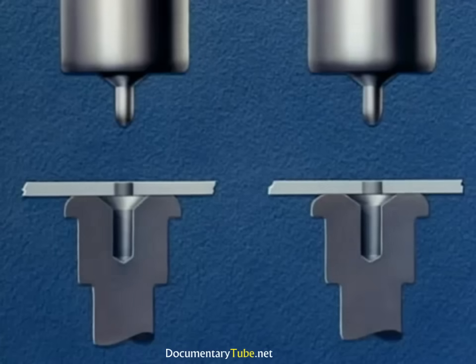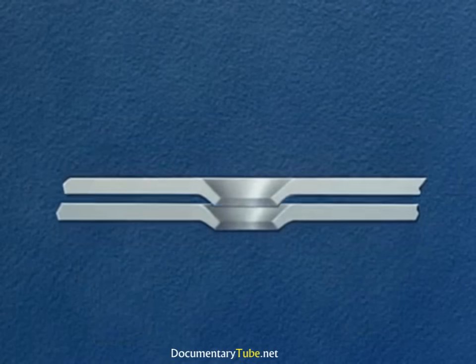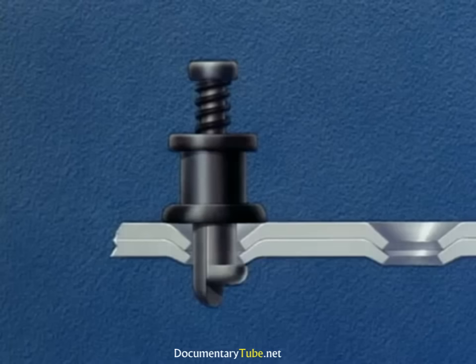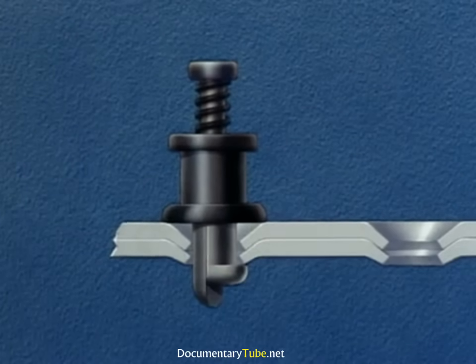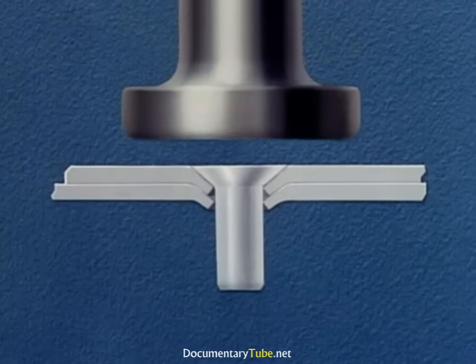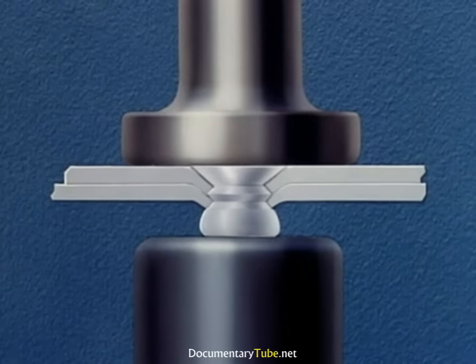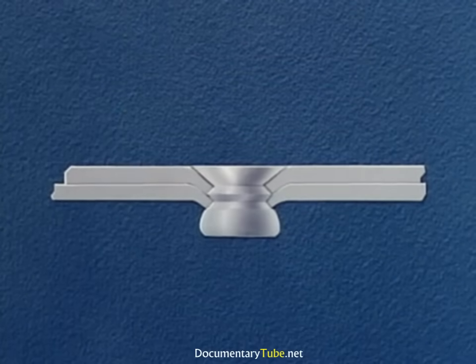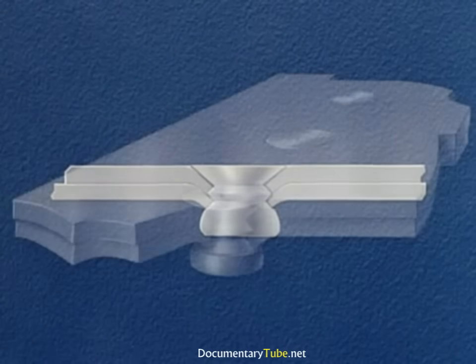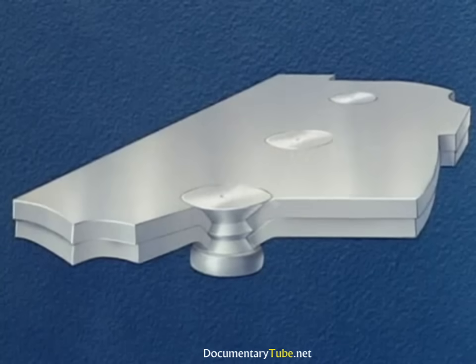This difference in angles is necessary in order to get a good nesting of parts. Upon completion of the dimpling operation, the parts are reassembled. Sheet metal riveting clamps are used to hold the parts together until riveting is completed. The rivet is inserted, and from here the work proceeds using a regular flush riveting set and the ordinary bucking bar. It is very important that the rivet be driven straight. We have just illustrated the pre-dimple method of riveting, where sheets were taken apart and machine dimpled separately on the squeezer. This method is used when the sheets are too heavy for the double dimple process.